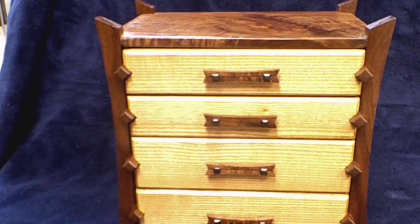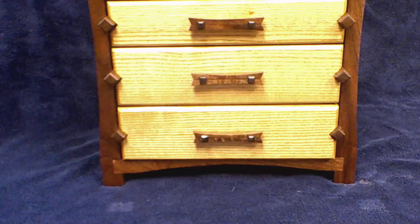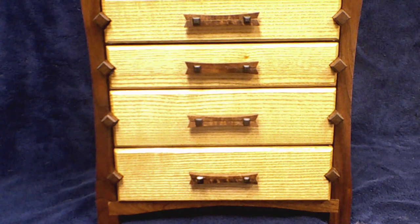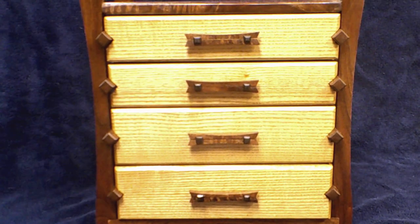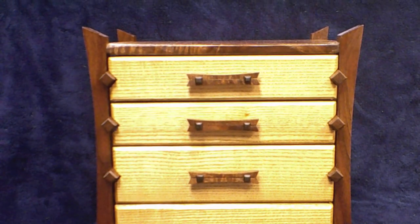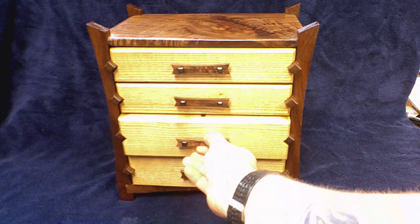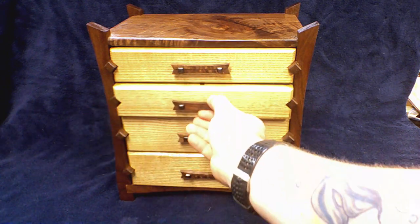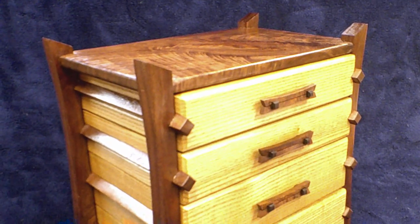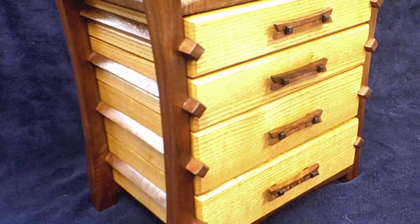I love it when a client gives me free reign on a design, and that was very much the case here as she only had a few stipulations for me to meet. First, she wanted it to be of my usual design style, which tends to be heavily Asian influenced. Here you can see the organic curves sort of growing up from the bottom and the sweeping arches of the drawer pulls helped to accentuate the flow. Second, the chest had to have three to four drawers with various divided compartments, so I elected to go with four drawers with one, two, four, and eight compartments respectively. I have been wanting to try out these diamond shaped drawer guides for a while and this gave me the perfect opportunity to do so. I feel these tie the whole piece together nicely.